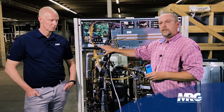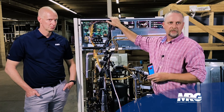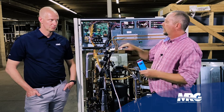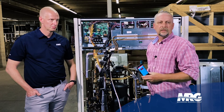One thing to note about this mode: do not cycle power to the condenser. It turns the mode off if you cycle the high voltage to this condenser. So if you happen to do that or forget something and have to power it down, just remember to go back through the steps and put it back into forced recovery mode. The app helps. You'll also hear the audible clicking of the valves to confirm you're in that mode.